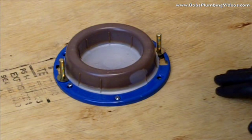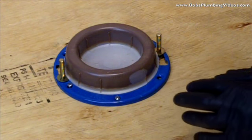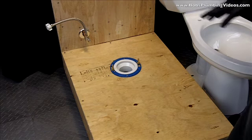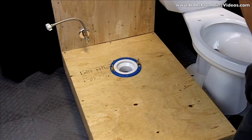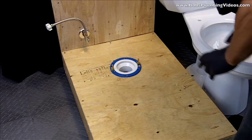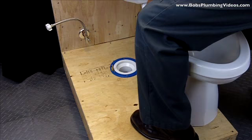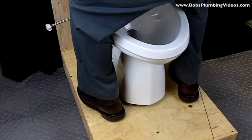At this stage it's a matter of taking our bowl and setting it on top of the new wax. Now we can imagine we have our wax gasket right there. It's a matter of lifting up the bowl and setting it onto the flange and onto the wax gasket, allowing the wax to actually squish and form its seal. We're going to lift this up on top of the platform and I'm going to straddle the bowl — as you come down you're going to feel resistance from the wax.